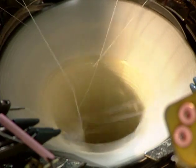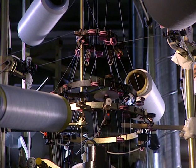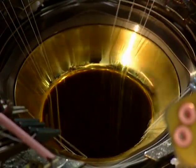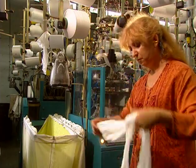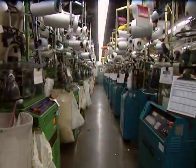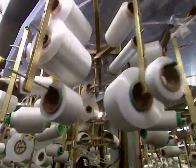The knitting machine goes into action. This one fashions a tube for sheer stockings in 90 seconds. In three minutes, it makes a tube for tights. Its speed is adjusted according to the product being made, varying between 750 and 1200 revolutions per minute. Once the tube is knitted, it is sucked up and lands in a bag where it will be inspected. More than 500 machines share the work, each making a specific model.